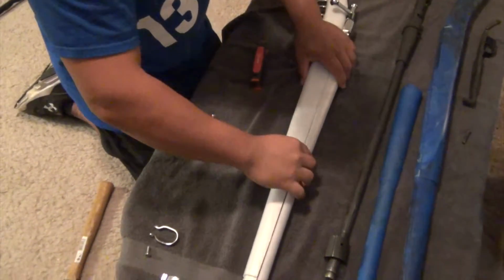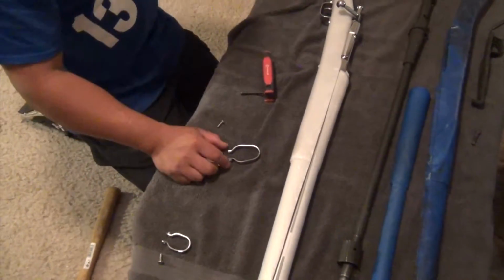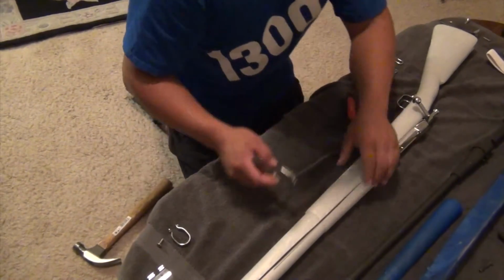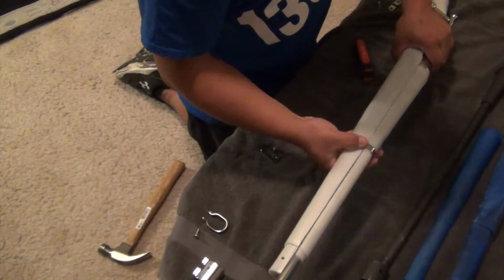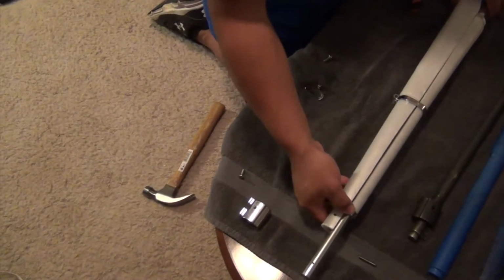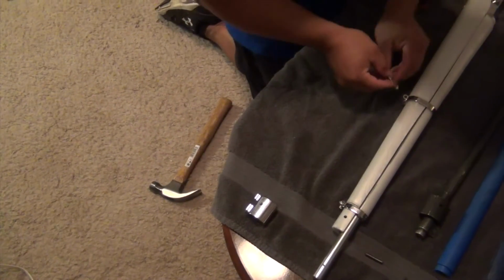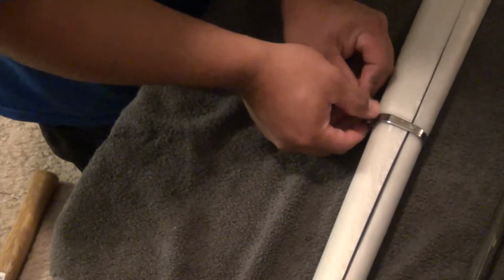Now, we'll place the upper sling swivel, stacking swivel, and upper band components onto the stock. The longer screws provided in the Glendale kit assist in ensuring proper fit of the bands to the slightly wider body of the stock. Slip the band itself down the stock. Next, install the stacking swivel band in the same fashion. There is no swivel piece that needs to be added here. Thread the screw through both the swivel and the band and secure using a Phillips head screwdriver.